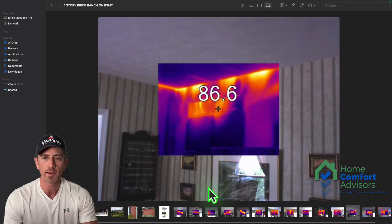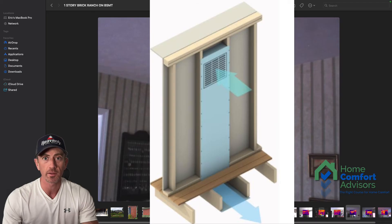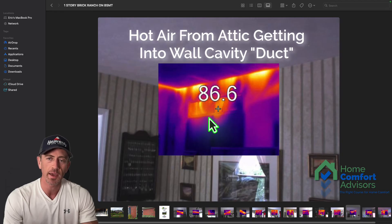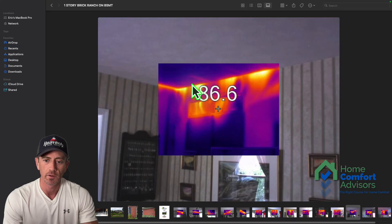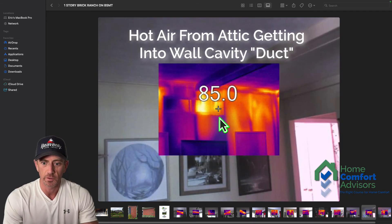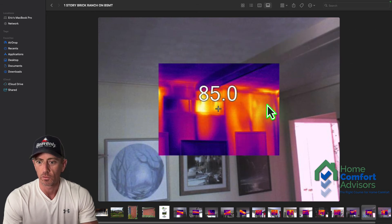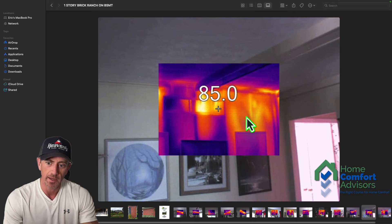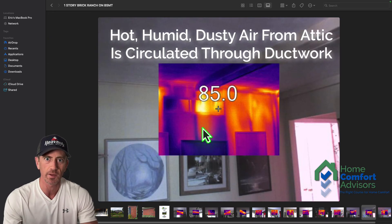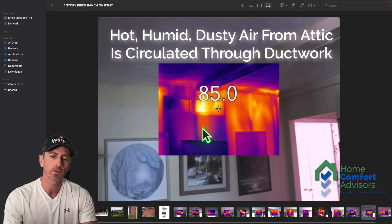When the heating and cooling system runs, air is sucked into the vent on the wall, goes down the wall cavity, and then through some floor joists back to the furnace. But at the top you can see hot air getting into that wall cavity because of top plate leakage — the top plate was not sealed to the drywall. Here's another return duct using two wall cavities, with the adjacent wall cavities showing a lot of heat loss from hot attic air coming down, and this one as well.